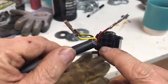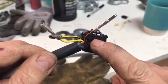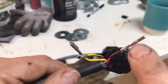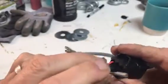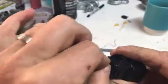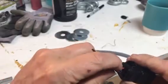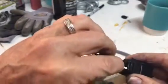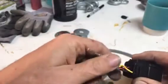On the back side you can see there's a little notch at the top of each hole, and if you look at your pins about halfway down you see a little notch too. Start sliding your pin in — put the notch on the pin on the side that the hole has the notch on. You'll hear a definite click, and it's all put back together. If you have some heat shrink you can put that back on.